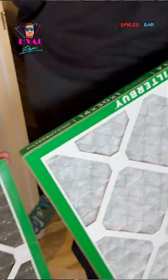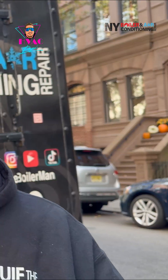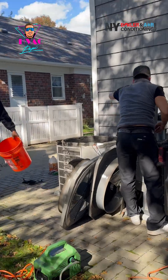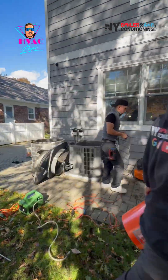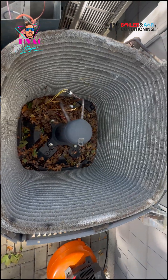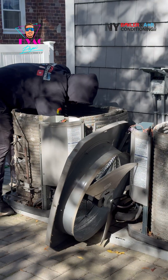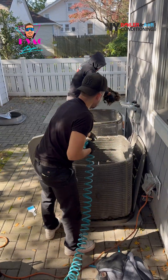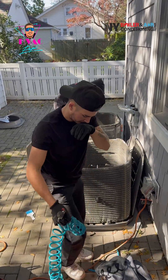In this case it's a little different, because the one in the attic has a condensate line going outside to your gutter. We just disconnected and removed the actual cover. Next we're going to get access to the inside of the unit — make sure there's no debris, leaves, branches, dead animals. It doesn't happen often, but it happens. Make sure the inside housing of the unit is clean.